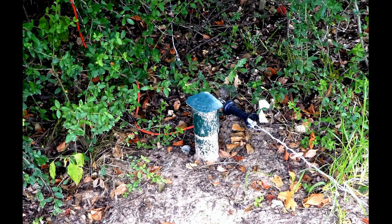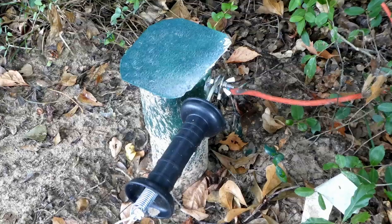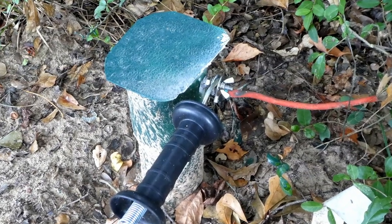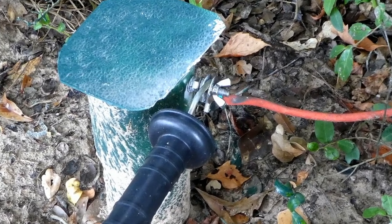This is a piece of 4 inch PVC pipe which I've sunk and concreted into the ground at the corner of my yard. The insulated hot wire in the photo is coming from the fence charger which is in a dry box near my house for powering the charger. I have this set on a timer so it only comes on at night, which is when the critters tend to show up.